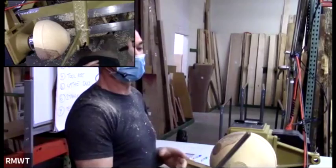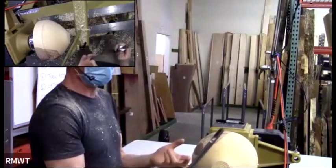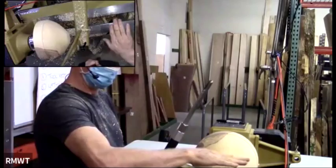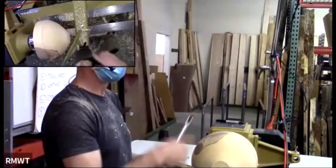So I remember racing my dad with my 40-40 gouge against the skew. It was a slaughter because there's just no way taking off material directly to finish can be matched with this, because the skew is a slicing tool, or if it's laid down flat, it's a peeling tool. But it isn't doing both at the same time. This is doing both at the same time. It's the only gouge and only tool in the history of wood turning that does both at the same time. There is no tool that can slice and peel volume directly to finish.